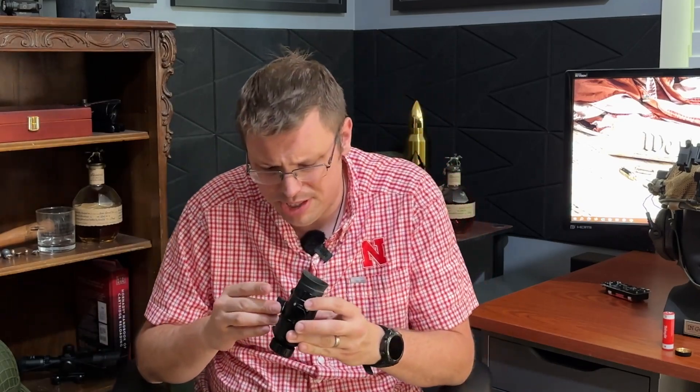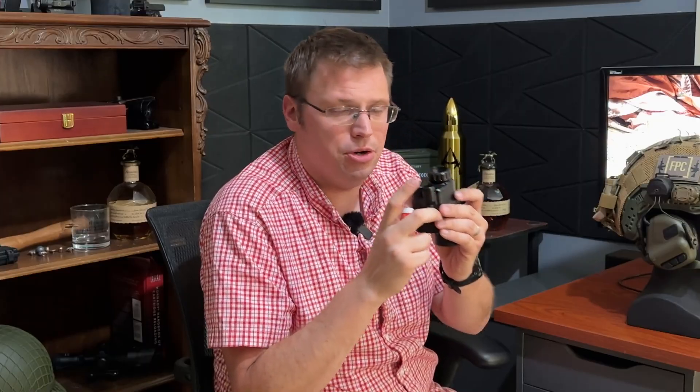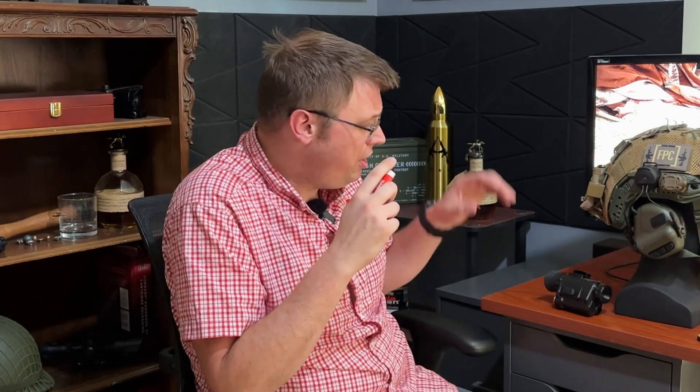Let's get into the meat and potatoes of today's video. You may be wondering what the added benefit to moving the battery out of the NVG30 housing into an external power source would be, other than being able to potentially add to the overall battery capacity. The added battery capacity is a huge benefit. The NVG30 is rated for up to five hours of battery life; however, that's only if you're not using the built-in illuminator and you have all the settings turned down to the dimmest. If you're using the NVG30 at its full power, you're cutting that battery life down significantly. So even just doubling the battery life by having an external power source is a huge boon.